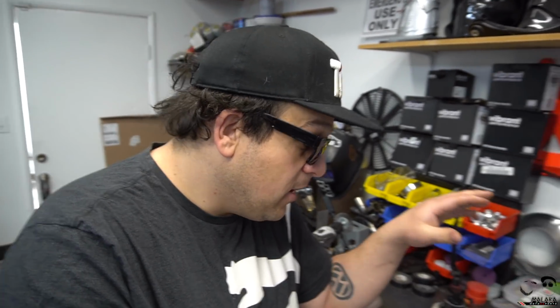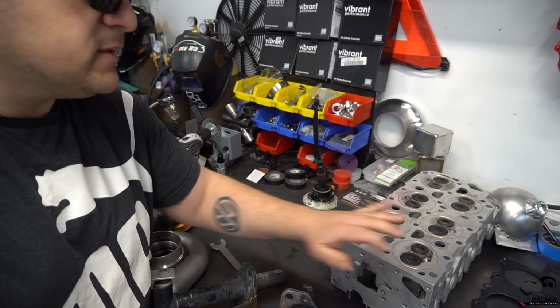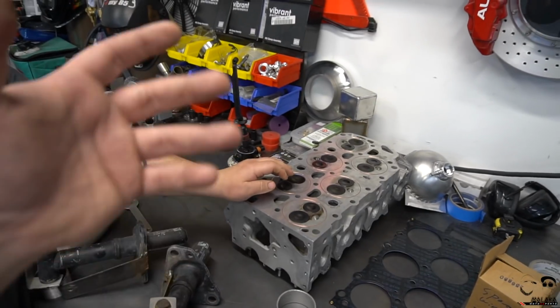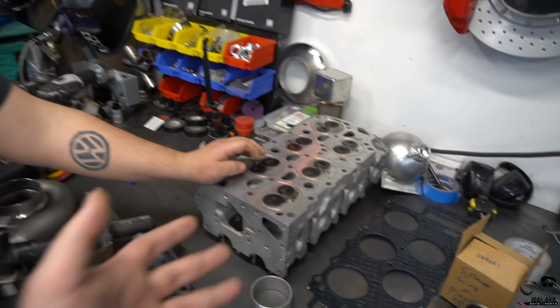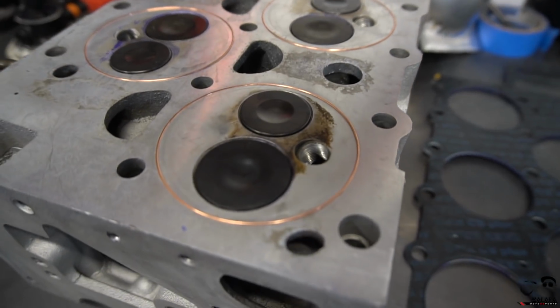Got it. So now they finally have it rebuilt again. We have videos of it being pressure tested, vacuum tested, and everything now is perfect. Okay, and just to clarify, Force Fed Engineering redid your head, installed new valves, lapped them, O-ringed it. It's got this copper O-ring. What size copper O-ring is it? That's 41 thousandths wire.